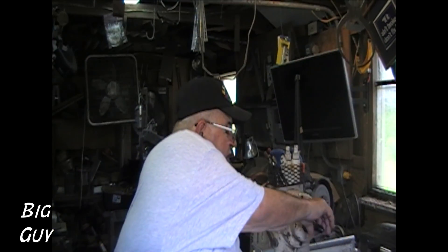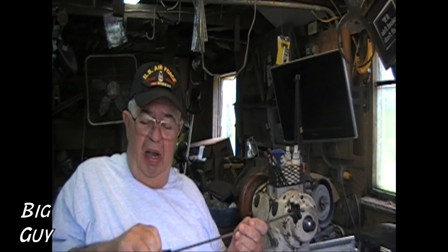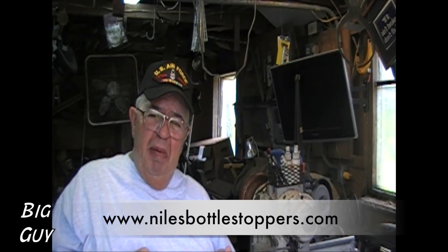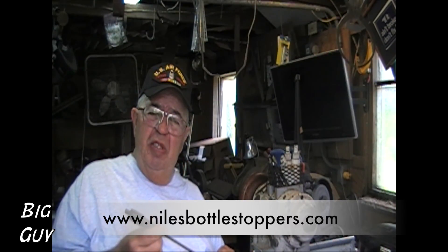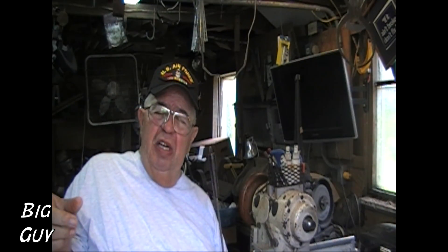Last time we visited, I was turning bottle stoppers. I'm going to go back to these — they're fun and I can polish them out to make them look like a diamond. We were using a mandrel made by Ruth Niles. I'll put the address up. She makes this mandrel for holding that, and I put a draw bar in it. I was surprised how many of you got a hold of me asking what the hell I was talking about with a draw bar. This is a Morse taper — it fits in the Morse taper and uses friction developed by the contact of all the surface from top to bottom and all the way around. Morse tapers hold very nicely but they can be popped out — the Morse taper in my drill press popped out while I was sick and corroded in there.